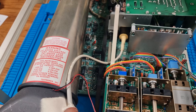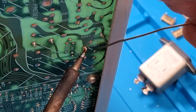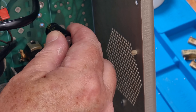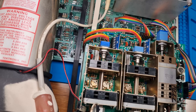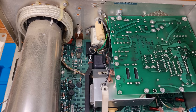A few minutes after I turned it on it sparked and sputtered inside, then a pungent smoke escaped from the vents, and this was followed by a loud explosion. I've only serviced the scope once since I owned it, many years ago, to replace some differential amplifier chips. But I suspected the current problem came about by the failure of ageing capacitors, and an autopsy proved that this assumption was correct.